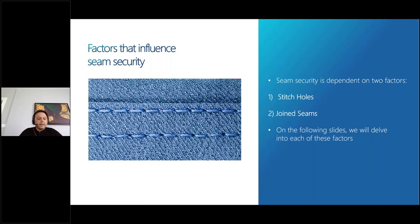Please keep in mind this logic — we will explain in more detail. Needle point is very crucial: according to the needle point, the shape and size of the stitch hole can change. We also have special threads with special thread finishes and special chemicals on the sewing thread surface, which help prevent entrance of fluids, microorganisms, and particulates inside the products.